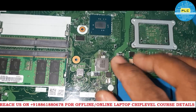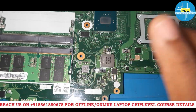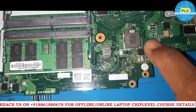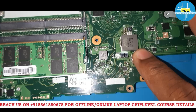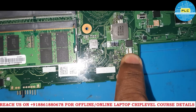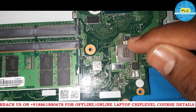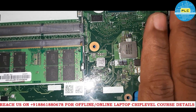If it is completely short, we can remove it easily. But it was not completely short. When I was checking, there was a beep. It has two dual MOSFETs — meaning a total of four MOSFETs for the 5V section. One I removed because it was short. Then I removed the jumpers — this side was short and this side was also short. When I removed this capacitor, the short was gone. I confirmed the 5V is generating.